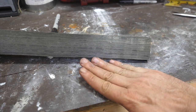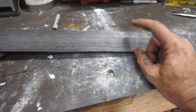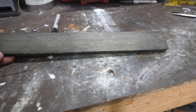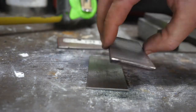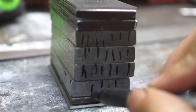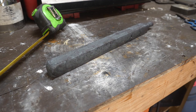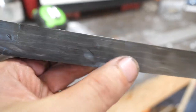There's some decarb here — you can see that bright etching. I need to put that face down or on top of the next billet, but I'll have to grind that cleaner. For the most part though, you can't see any decarb and you can't see the lines. We cut that last piece into four pieces and we're going to weld these together but add some more bits on either side to alter the pattern and give us more material. It was squared, manipulated, and drawn out to prepare for the four-way weld. That looks great — very clean. We should be able to avoid the issues we had with our last knife.